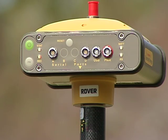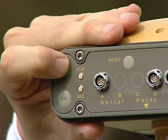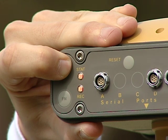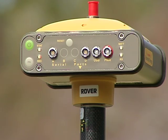You will want to stay at this point in occupation mode for approximately two to three minutes. After you have collected all of your points, you will stop the entire session by pressing the power button and holding it until you see the two red LEDs — at this point, you will be in zero power mode. I will now store the receiver and bring it to the office to download all the data. In stop-and-go surveying, the base and the rover are not communicating with each other. Thus, when you post-process the data, you will need to have both files: the static data from the base and the kinematic data from the stop-and-go roving receiver. At this point, you should know how to perform static and stop-and-go kinematic surveying.